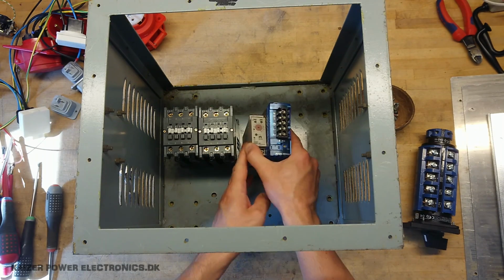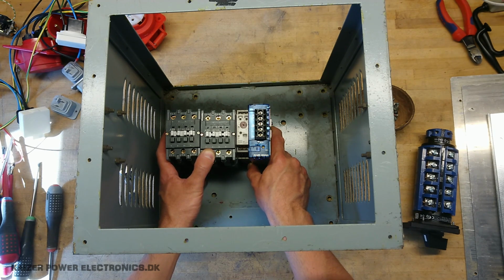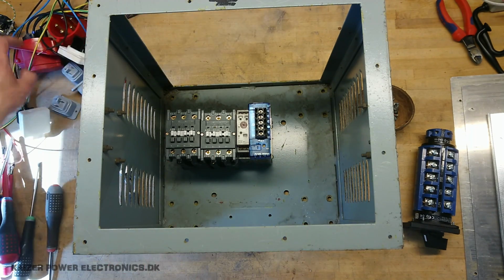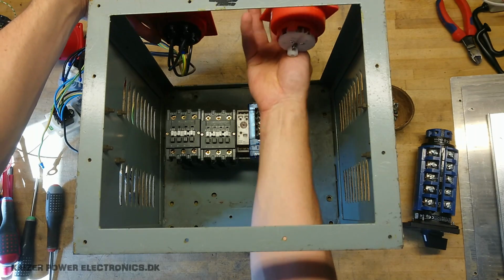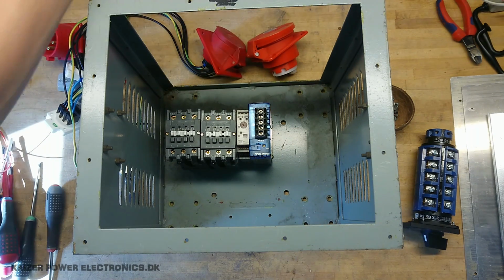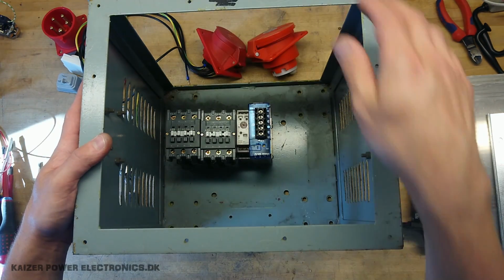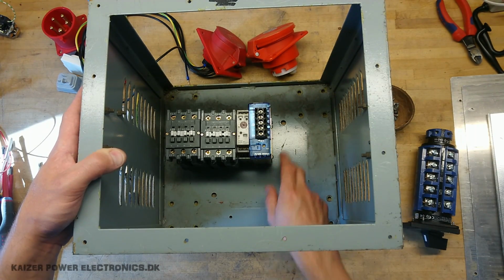So it's just about getting the DIN rail components. Yeah, they can practically sit anywhere, it seems. And of course we have the safety relay, but that's just another normal unit here. All the output plugs would then be mounted on the opposite plate over here. Preferably the large ones furthest down, just to not have any heavy cables pull down the plate over here, and then all the smaller 230 volt AC up in the top. So yeah, I guess there is not much else to do than get the DIN rail.